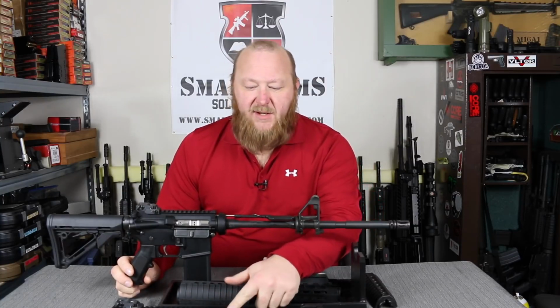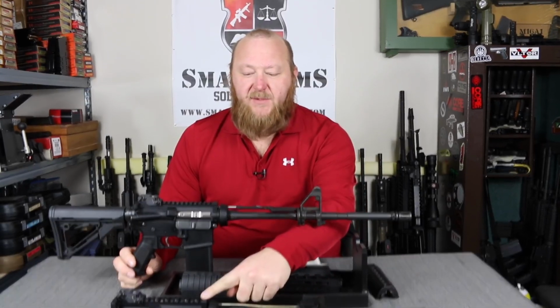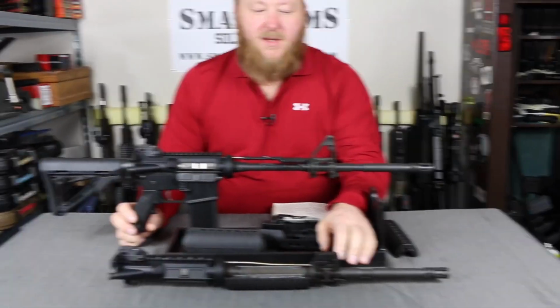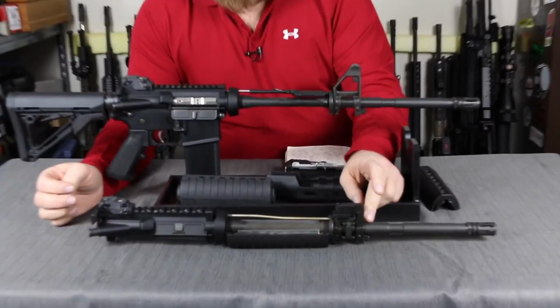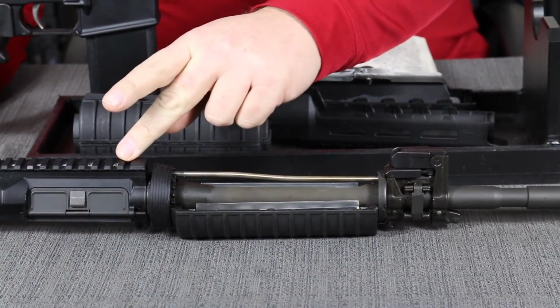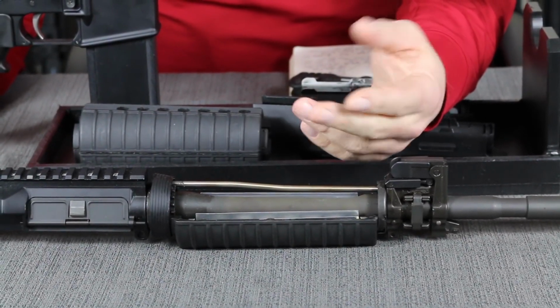What we see here is a standard M16-type direct gas system, or internal piston, as I like to refer to it, because the piston chamber is done inside of the bolt carrier group. Now, what a lot of the argument stems from is the fact that gas is tapped from the front sight base through the tube into the carrier, and the expansion chamber is made up between the back of the bolt and back of the carrier.